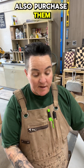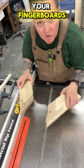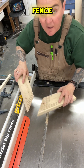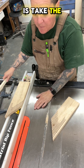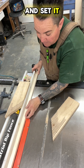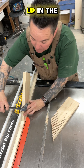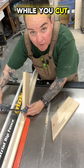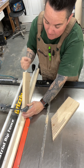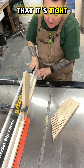You can also purchase them — this type actually came with my router table. To set up your fingerboards to hold the material on your table saw, you're going to clamp one to the fence and one to the table. First, take the piece you intend to cut with the blade out of the way and set it there so you can set your fingerboards in the perfect place. Then tighten down your clamp and give it a little push so that it's tight.